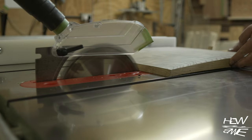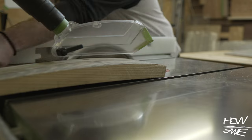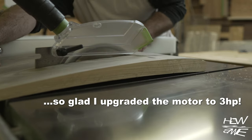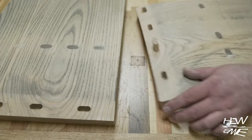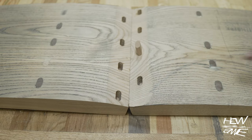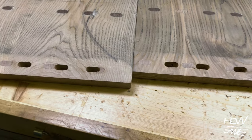In the end I thought this was a better idea. I obviously wasn't very awake that day as you can see — those mortises don't line up because I sawed the wrong sides off. Anyway, I filled them with dominoes, glued, and re-drilled the mortises.